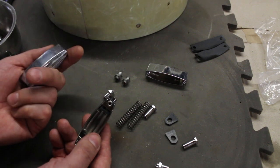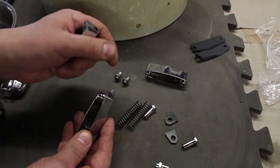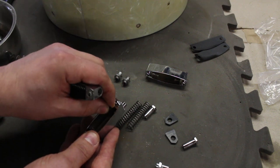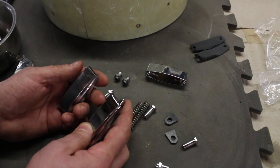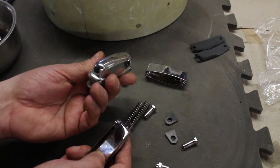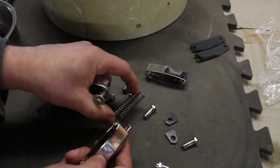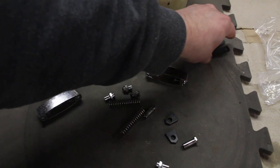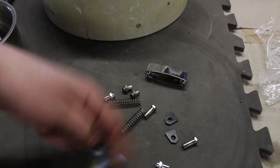The castings are really clean. They do use a different internal mechanism — longer swivel nuts with these little neoprene captive thingamabobbers, no spring, and the swivel nuts stick above the profile of the lugs. So we turned these oddballs into donors, pulled out their swivel nuts and springs, cleaned them up on the wire wheel. The repros also came with these gaskets, but none of the other lugs have them, so we're not using them.